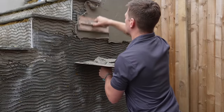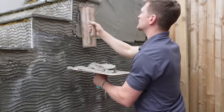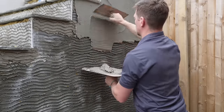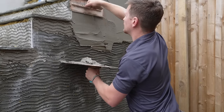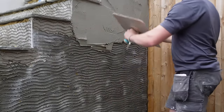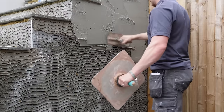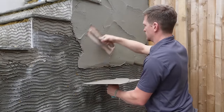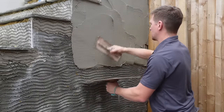You will drop a bit — I have just dropped a shed load there — but make sure all your floor is covered up, everything is protected underneath, because render as well as being a tough product to scoop up, it can be quite corrosive. So make sure you cover up all the areas that you are working over. The main rule of thumb when applying the render is lots of pressure, but don't try and get it dead flat. Don't be constantly troweling it off, because you will start to pull the moisture from the back of the render to the front, which weakens the product.